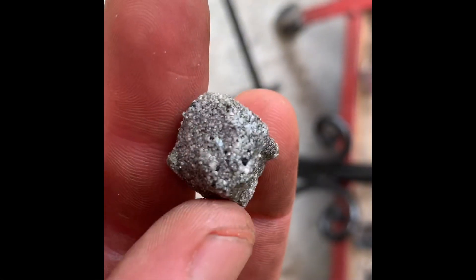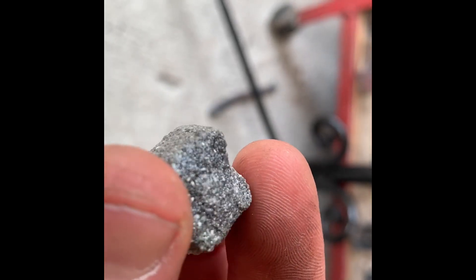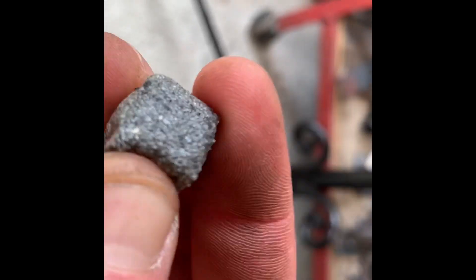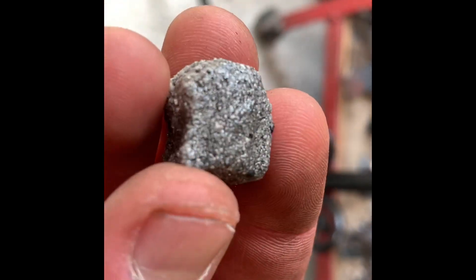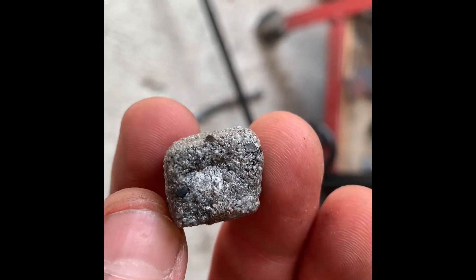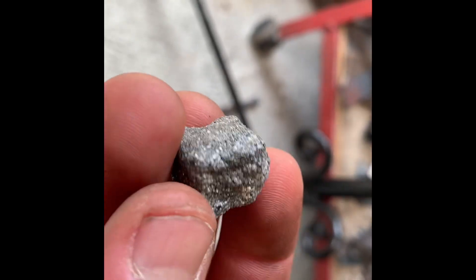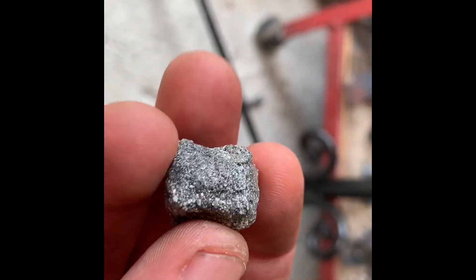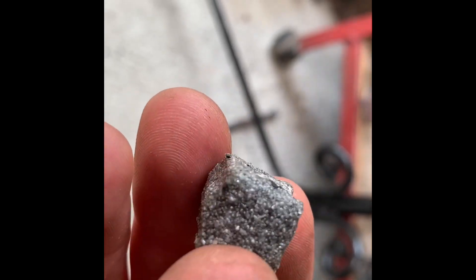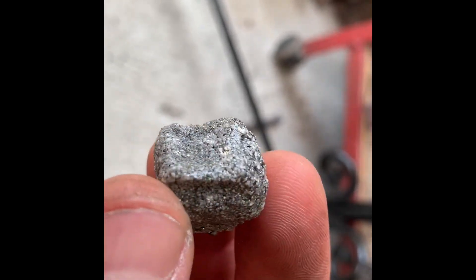Okay, so here's the small square. It does look very glassy. I might need to get a different type of sand, but it's extremely hard. It seems to have held up to the heat. I might have to scale it up a little bit and see how that goes, but it's a lot more successful than the previous attempts I've made making a refractory material. This is an ongoing experiment, so I'm going to keep on trying and I'll keep putting up new videos. Thanks for watching — I should be able to put up some of the other blocks I made in the moulds once they've had a bit of time to dry over a few days. Thank you. Goodbye.